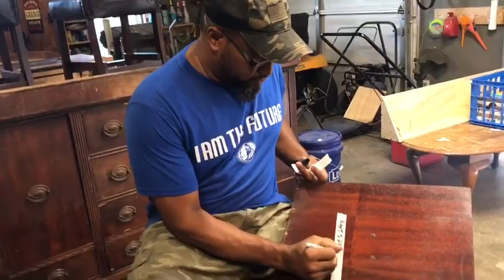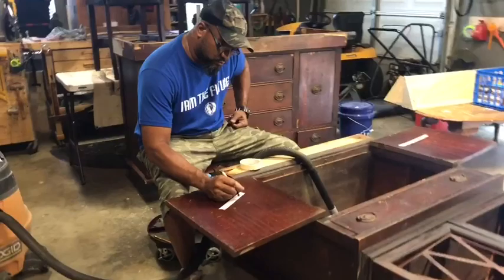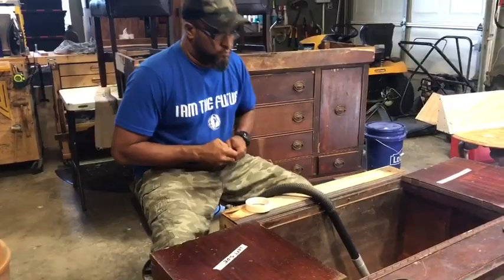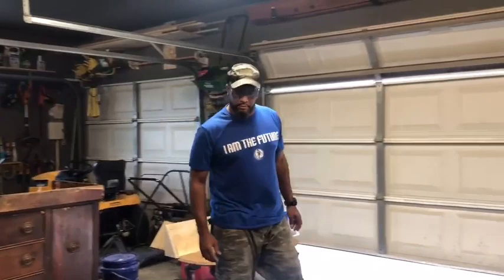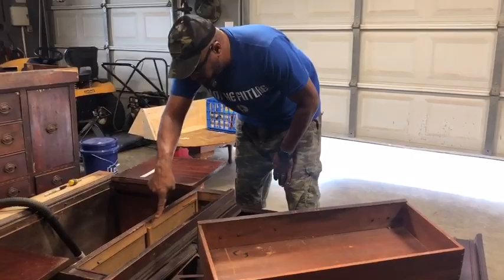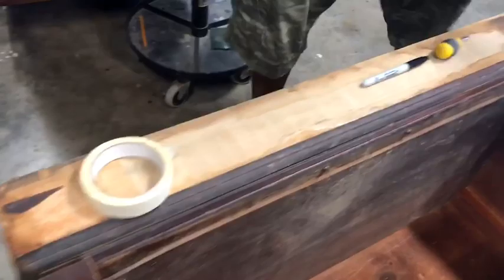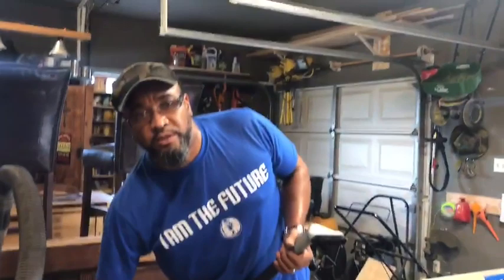Next, I began to label all of the drawers and doors to ensure that when I removed them, I could put them back in their proper places — this is essential when re-establishing the piece. I looked at the drawers and face framing doors to see if they were aligned correctly. I removed the drawers to check if the joinery and dovetails were still in place, and whether they needed any glue-up. The piece had been sitting for about 20 years, so it had all kinds of critters inside. I had to vacuum it out and clean it with Murphy's Oil Soap.